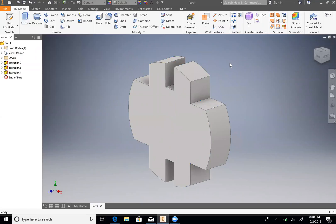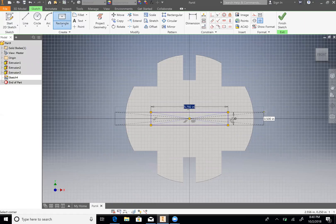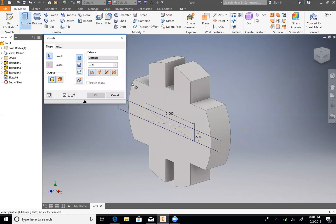And then we are going to do another 2D sketch on the front face. We're going to repeat that same process but for the horizontal direction. We'll do center there. We want to make sure that this one is 0.5, the length has to be 3, and then this dimension will be 0.5. Then we'll do one more center rectangle — make sure that it snaps to the other rectangle with 0.5 inches; the 6.2 inches doesn't matter. Then right-click and hit OK, then finish sketch, then we will Extrude these two, select both, cut, and then do To Next. OK.